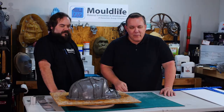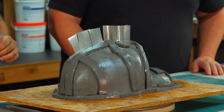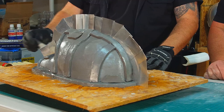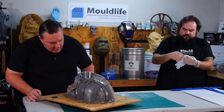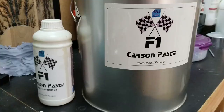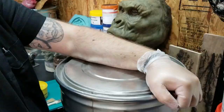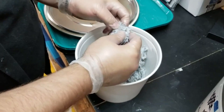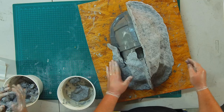We put another three coats of clear coat on it, which seals up the clay, allowing us to now put the shim stock in right down the center. The shim stock will keep the two halves of the outer shell from bonding to each other. Then we tape it up so it fits a little bit nicer — we use a heater tape. For the outer shell, we could use more stone or fiberglass, but instead Brandon has something stronger and lighter: F1 carbon paste — super lightweight, extremely strong. It's an epoxy-like putty mixed with carbon fiber strands, actually used on Formula One race cars for the body shell. We mix it with the activator and press it on kind of like paper mache, and it doesn't need to be very thick, which also keeps it lighter. We do need to wait for it to cure.